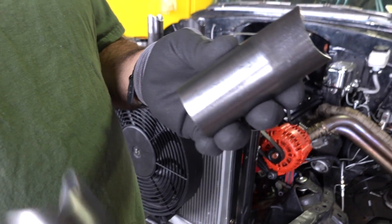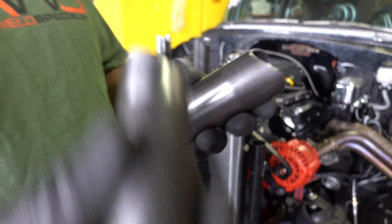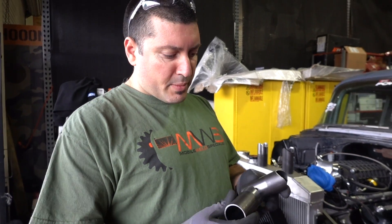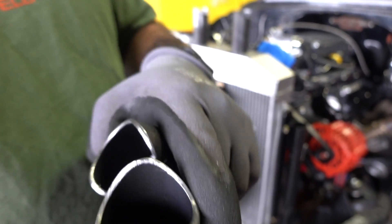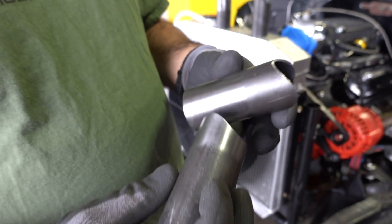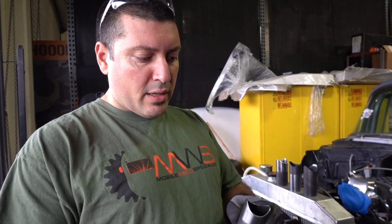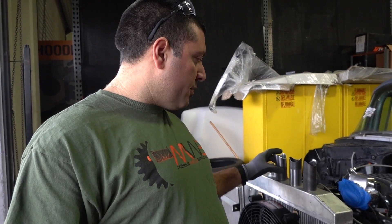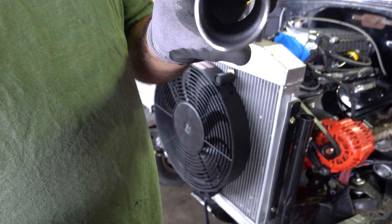You want the flat section to be nice and clean and prepped. You can wipe it all down with some kind of degreaser, acetone or something. That looks fresh - that's the most ideal scenario you can have. It's ground down so you have the full wall thickness, your tubes are prepped, and your landing is prepped, and you can weld that. It gets highlighted most when you're TIG welding. And you can take it a step further if you're having some contamination issues, which is prepping the inside of the tube also.